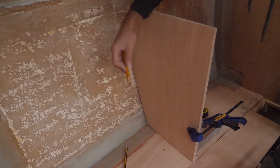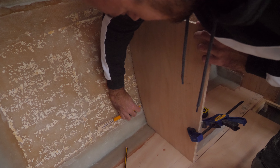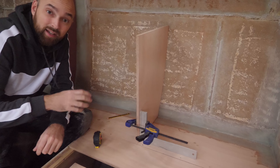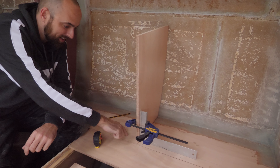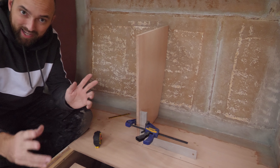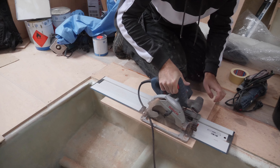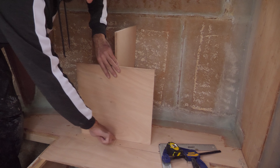As you can see there is a little bit of a gap down by the bottom — let's go ahead and get rid of that. Here I've got a couple of stir sticks and a pencil that's wide enough to span the gap, and I'm just going to use this to scribe the curvature onto the plywood. And there we go — that is about as tight of a fit as I can possibly get. I'm pleased with the support so far. I've got a pencil line on the bottom of the settee that marks the front of the back, but I need to trim this so it lines up with the back of the back, because there's going to be a piece of plywood that goes here and I want this to be 55 centimeters. Yep, that is perfect — I am right on the line.